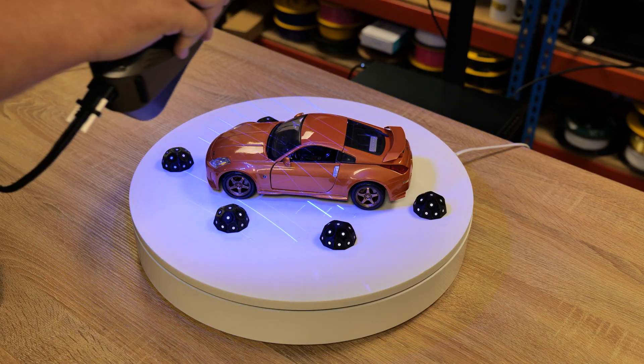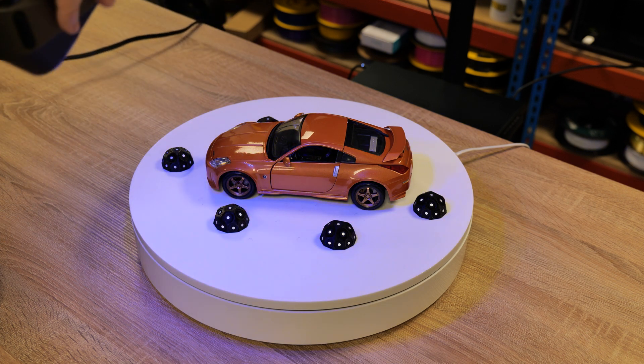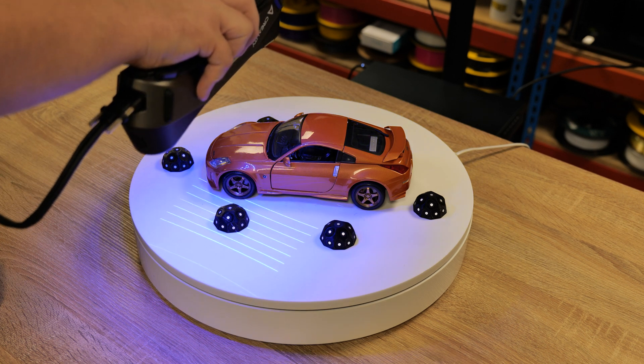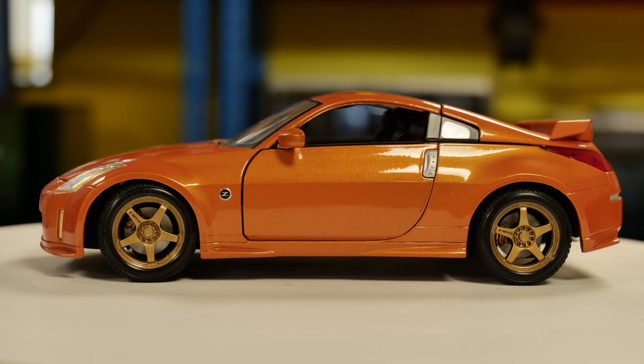We then tried a detailed scan of a model car — scanned twice, sitting it on the turntable with IR mode enabled, normal scan, medium size. One key tip when scanning any object: as soon as you start scanning, pick a starting point that gives you as many reference points as possible. This helps you maintain tracking, and if you do lose tracking, you have plenty of points to reference back to in order to regain it. This works incredibly well in both IR and blue light modes.